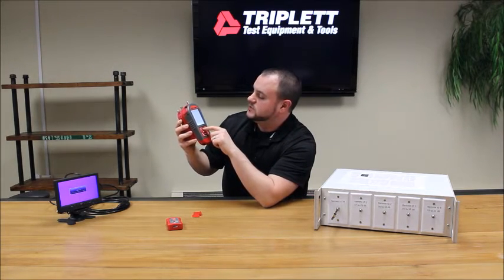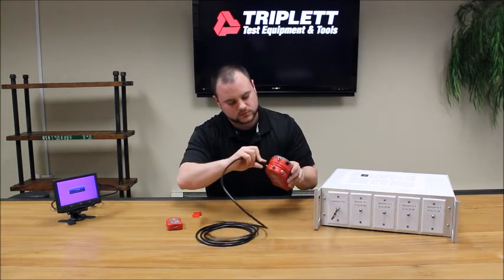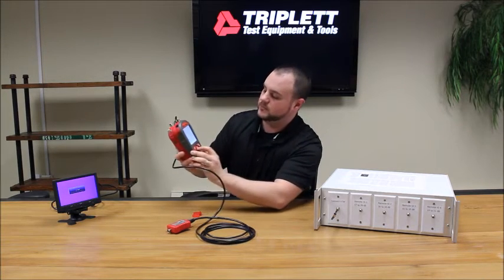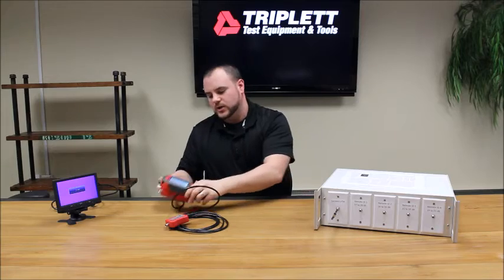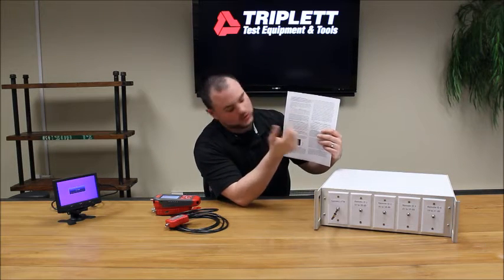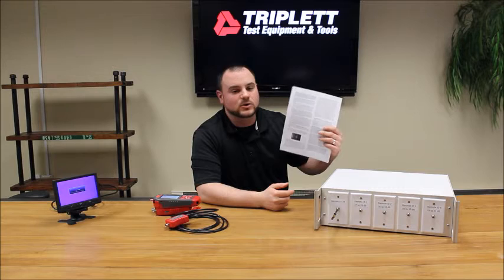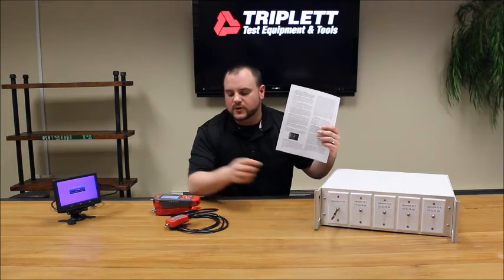The first test I'm going to do is the HDMI test. I have a standard HDMI cable here. I'll plug it into the top port, then use my remote on the other end to identify all the pins in the HDMI cable and determine if it's a good cable. Press OK — the hammer icon lets you know the test is being done. It says it's connected to remote one and it's cable one. Cable type one means all pins — one through 18 — are connected. If you see cable two, three, or four with a few pins missing, that just means it's made to a different standard, not necessarily a bad cable. As long as it works for your installation, that's fine.